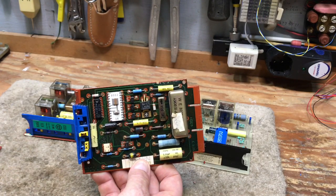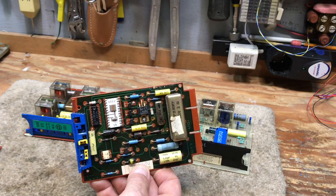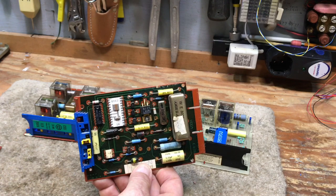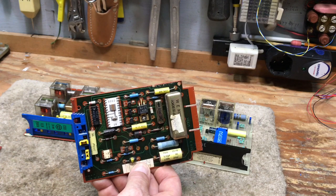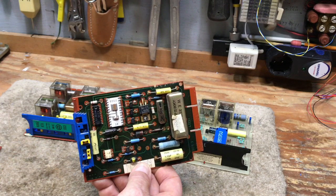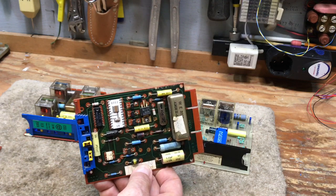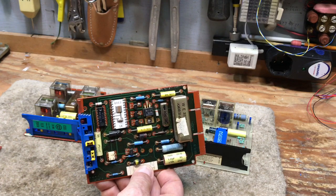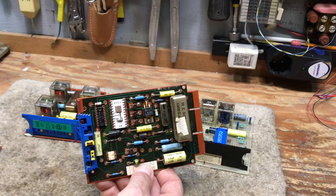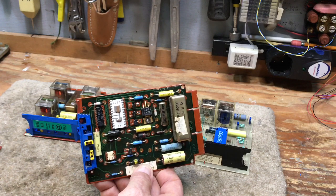There's a timing circuit in here that when you go off hook on a telephone and try to place the line card on hold, you have to wait a certain amount of time, or the line voltage has to have enough of a change before the KTU will allow the line to be placed on hold. This was done to prevent people going off hook on phone lines, putting them on hold to busy the line out for lunch.